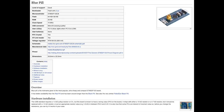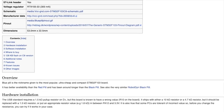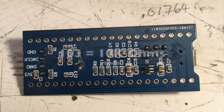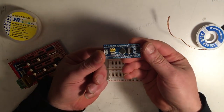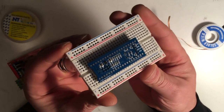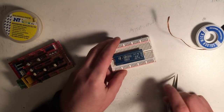The meat of this video: if you go to the STM32 Duino project and look at the Blue Pill page, scroll down to the overview and under Hardware Installation you'll see a note about the pull-up resistor being incorrect. And they are right about that. It's usually either 10K or 4.7K — usually I've found it 10K. You can tell by looking at R10 and seeing if it reads 103. This is what it looks like on the bottom. So this one I have right here is definitely wrong. The way I do these is since they have the little boot jumper pins, I just stick those into a breadboard so it doesn't creep around too much. Right here you see R10, and that's what we're going to have to swap out.